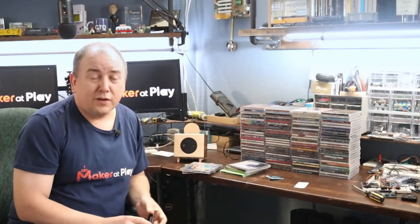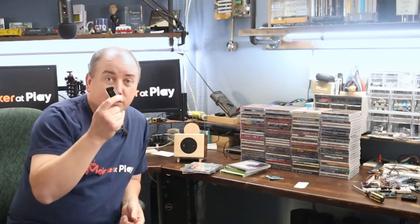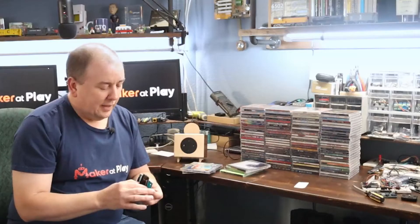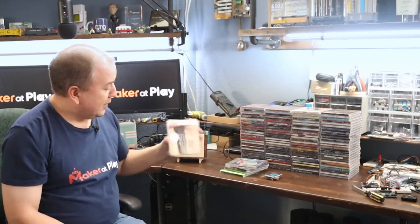So what is this powerful magic that's inside this box? What's in there is an ESP32 microcontroller — this is like an Arduino but with built-in Wi-Fi. I took the microcontroller, hooked an RFID reader up to it, and then took some NFC tags and placed them onto the back of the CDs.